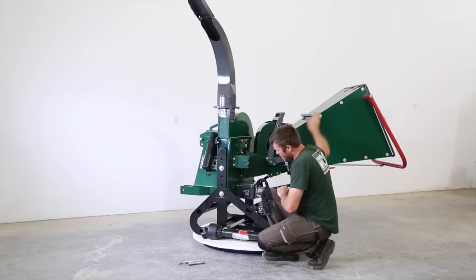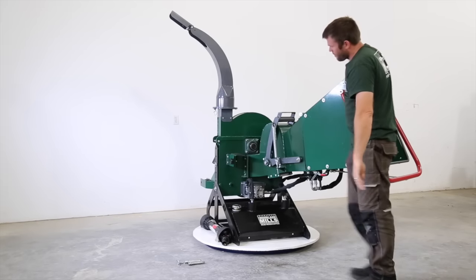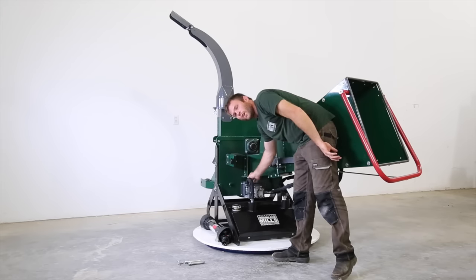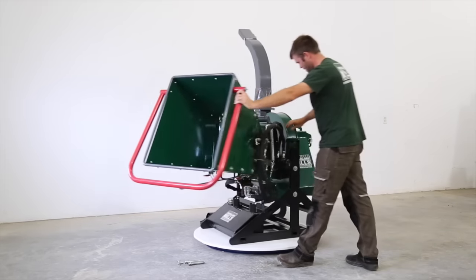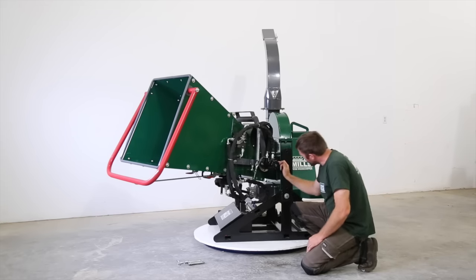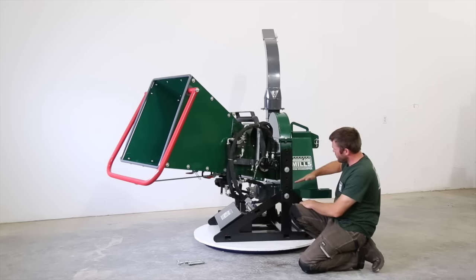On the other side, even in the legs you've seen, we've done all pass-through design with the welds on the inside. The arm for the tensioner on the belt passes through to locate. Our pump and our Lovejoy connection are all put through a central hole, again, laser cut. On this side, it's not much easier to see, but again, the arms pass through. Our connections here are all seamless welded all the way around. If we were to look up inside of here, it's hollow in the back. So I can get up in here and do these bolts because the inner follows the diameter of the flywheel.